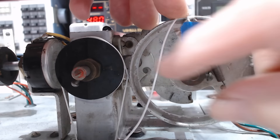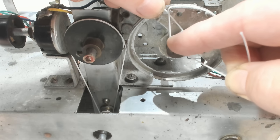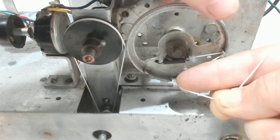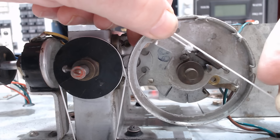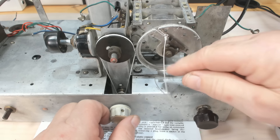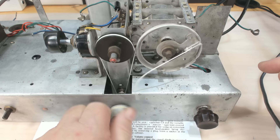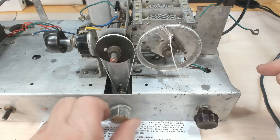Now around here twice and then back onto the big pulley. I'll wind this back a bit — this has to go in here, then tie it on the end of the spring. I've pulled that in there, pulled it tight, and just made sure I can get full travel — it's fine. All I need to do is tie that onto the spring there at that end, and we're done.